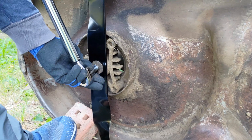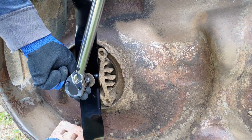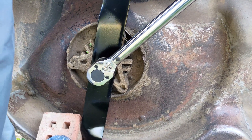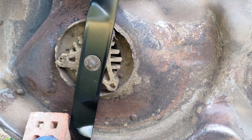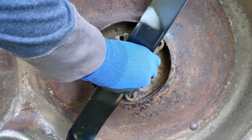I used an old brick on the left side of the blade to hold it in place, and I gently moved the torque wrench to the right until I heard the click. Once the torque wrench makes the click noise, it's important to stop as the correct torque value has been obtained. Next, I repeated the entire procedure again for the second blade.